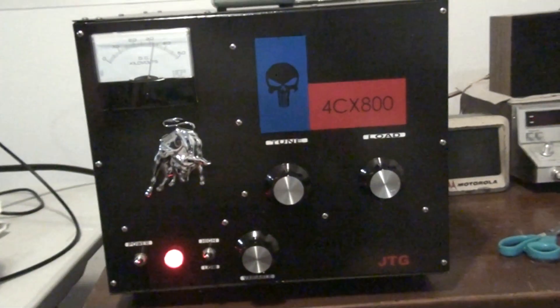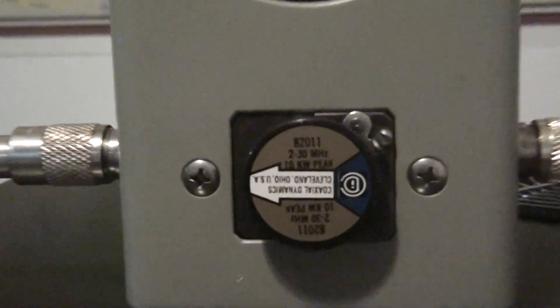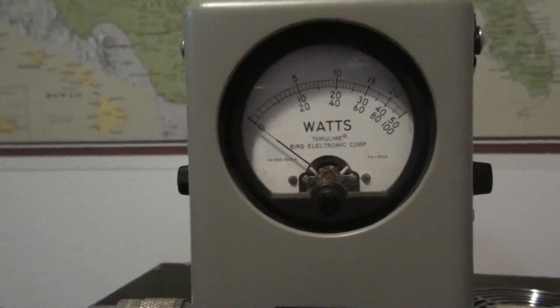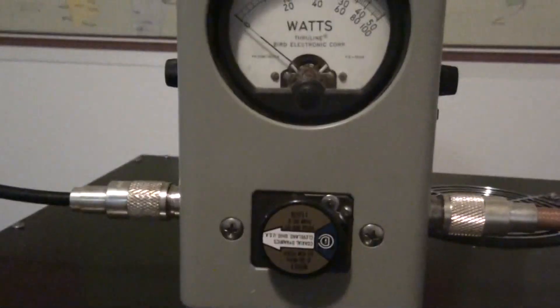But anyway, let's get on with it. I've rambled enough — that's five and a half minutes of me just talking, but I have to put some important information out there before I do a video on the amp. Let's take a look up here. We've got our blower right here, blowing out some nice lukewarm air. Tuned input on the back — input, output. You do not need a foot pedal for this. Again, it does run 220. You've got two fuses in the back and an additional ground if you have a ground rod outside you want to use. Tune this amp for peak output. I've got a 10kW slug in here. We're going to test it on average power, so we're looking at the bottom scale. 20 is 2,000; that first large hash mark before 2,000 is 1,000. We want to hit 1,000 or better.